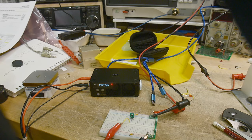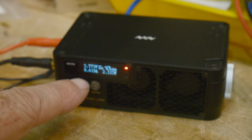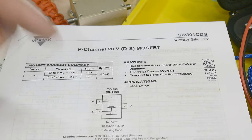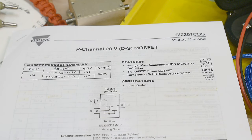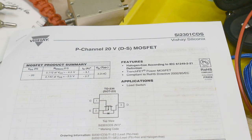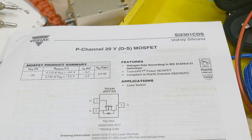120°C — well, that's just a quick look at this little part. We are running it at 618-619 milliamps. The claim to fame for this little guy is pulse — six amps pulsed with really short current spikes. I don't know exactly what use case calls for that, but there must be one. If you're going to use it DC, as I just showed, probably around half an amp you could get away with. The chip of the day was an SI2301 CDS by Vishay.